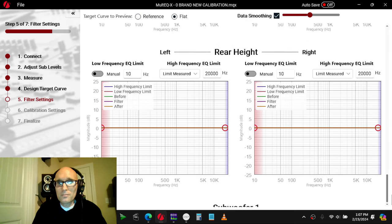Now, one thing to think about, if you did change your room curve to, let's just say, 6.5, because it's peaking less, you might be able to get away with more roll-off, right? So again, this is why SPL balancing in this way is useful, to see in the grand scheme of things, when the levels are the same, where are we rolling off? Because what I was doing was turning up the receiver and saying, that volume looks about right, I need to cut here. And it was not a very good way of doing it. When you SPL align in this way, you can now see where I should be rolling this EQ off. This is exactly it, where it meets the performance of the original one. So, all right, let's move on.